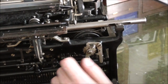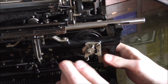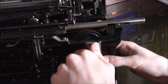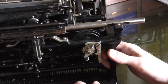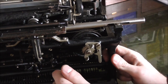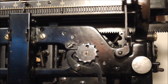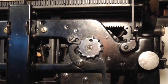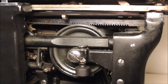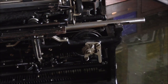Should you ever snap a band on the Continental and need to bring it back up to tension, you can do this very easily by releasing the ratchet here and then just twisting the spring up to tension. That cannot be said for any of my other machines. On one machine I had to drill a hole into a cog just so I could tighten it with a screwdriver, and on others it is just a tiny thimble with a worm screw which you have to turn basically forever to get up to tension. This one really has the best mechanism of the lot.